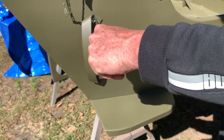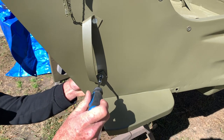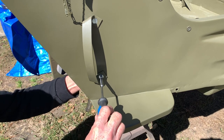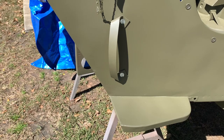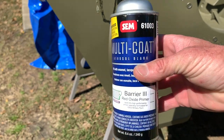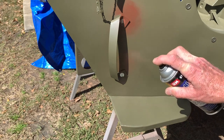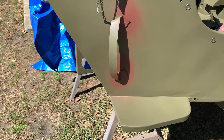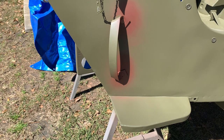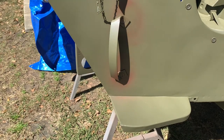I like to clock the screw heads — in other words, keep them in line. That probably wouldn't have been correct from the factory, but I think it looks better during my restoration personally. Once I get all the fasteners tight, I will be using the Barrier 3 Red Oxide Primer from Ron Fitzpatrick Jeep Parts to prime them first with a good light two coats. My intention from the beginning of this project was to paint all the bolt heads, screws, and fasteners — I've put two coats on the outside of the tub, then I'll prime everything and go back with a couple of coats from the rattle cans. When I'm finished with all the add-ons, I'll go back one last time, scuff all the paint, and coat everything one last time with the 33070 for a uniform coat. The rattle can paint matches exactly the paint I used on this body tub a few months back.